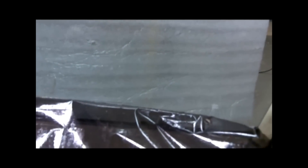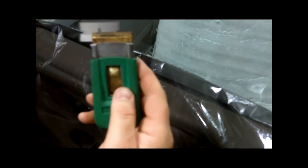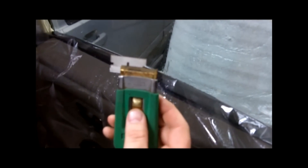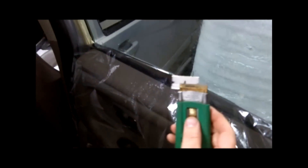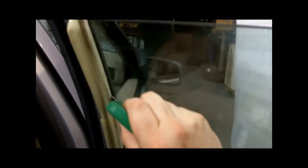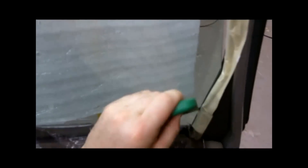That's a pretty cool trick. I can get stuff you can't see that might find its way back into the next film, and I can do it on the sides too. Here's another trick if you don't have an Olfa blade — the offset blade technique. It's one of my favorites. A quick way is to just keep the scraper already in your hand, offset the blade a little bit, and you can get all the way into the cracks of the window. I'm going to stuff the blade into the crack and work it all the way down to get any glue I might have missed, and I'll do the other side as well.